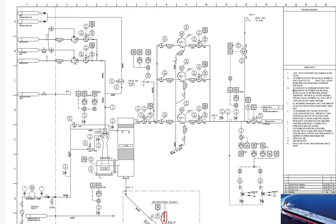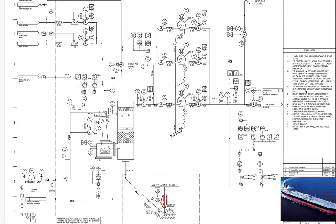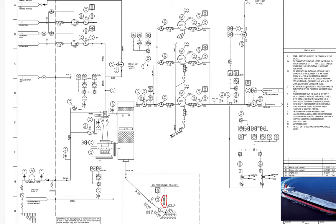Let's see note 1b, located here on the bottom. It states that the associated seawater overboard discharge points, downstream of the scrubber, must be four meters below sea level at minimum operational draft condition. The drain pipelines must have a continuous fall with a minimum slope of 15 degrees over the ship's full trim range.